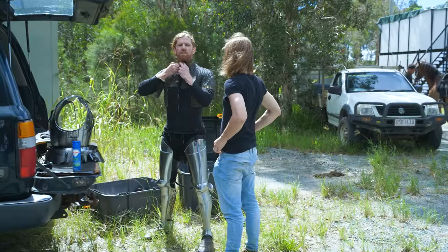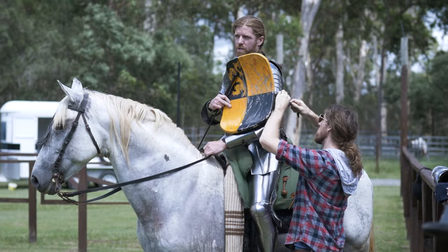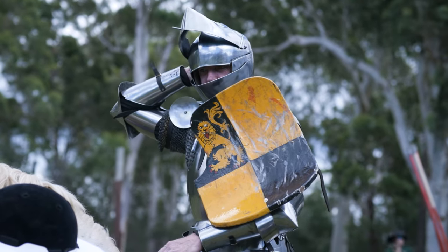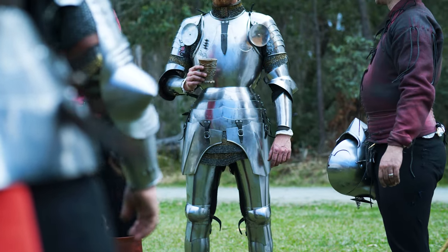To be real armour, it's fulfilling a real purpose. That translates directly to the forming of the steel — if you can't wear it and use it, it has no value as a wearable piece. Secondly, it has to look right for the period or the design you're making. As we talk about here in the workshop, different regions have different design elements — not just in the artistic design, but in the engineering design, the way that they make it work and function within itself. All of those elements are critical to creating what would be considered a historical armour.